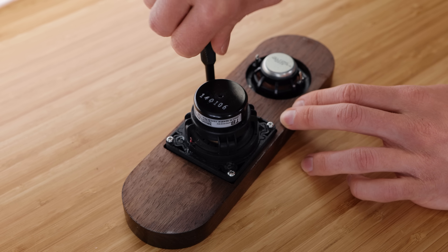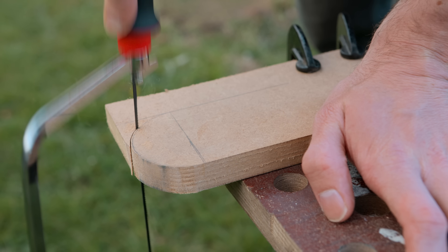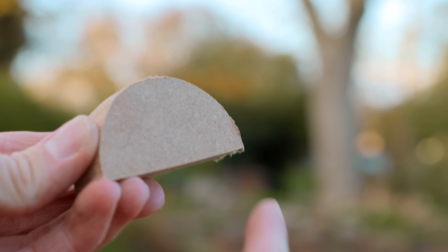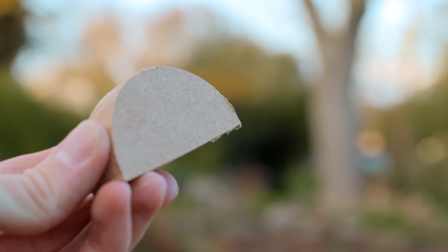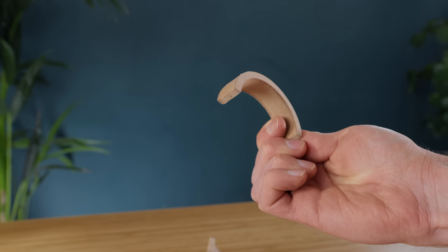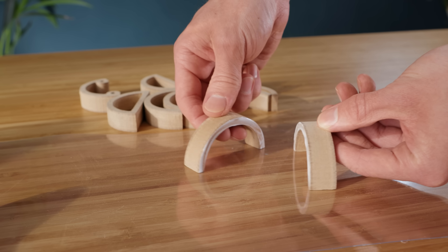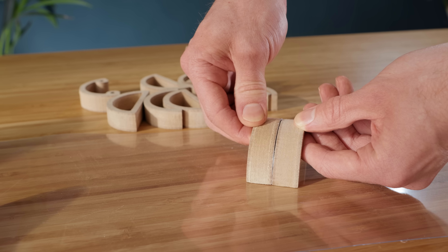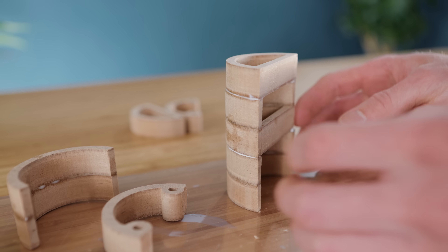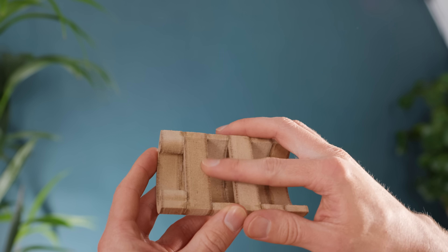To make the rest of the enclosure — as the shape is a bit unusual — we need to cut out various semi-circles from thick MDF, with the intention of gluing them together into stacked layers. I utilised my CNC, which allowed me to refine them even further into U-shapes. The advantage of this is that, thanks to the centres now being essentially hollow, it increases the internal air volume so that the enclosure can be about 4cm shorter. It's not that much of a difference really though, so you won't be missing out on much if you do yours manually.